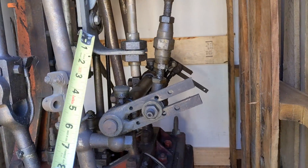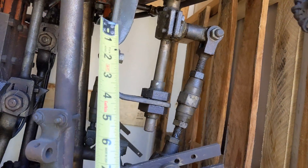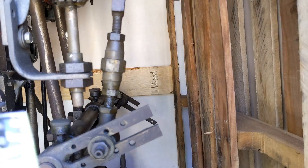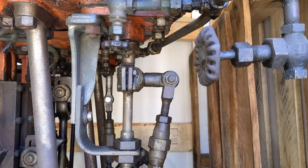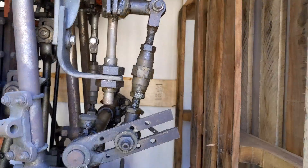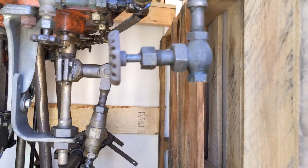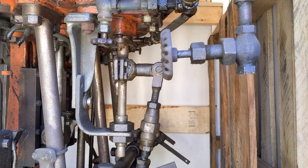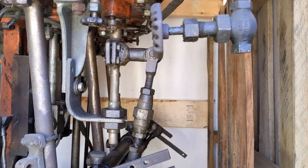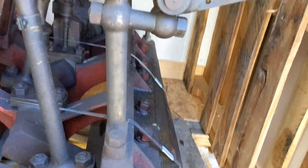Looks like maybe some farm repair, or actually like a homemade valve stem guide, which is a good idea because valve stems have this weird angle the rod is pulling on them — you could eat up your packing or the bushings for the packing and the guide. So having a valve stem guide is actually a really good idea. It's turned front columns, cast back columns. Let's take a look at the stroke.